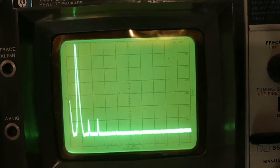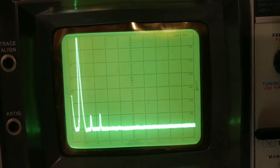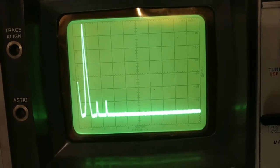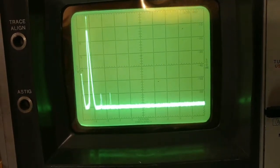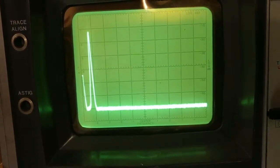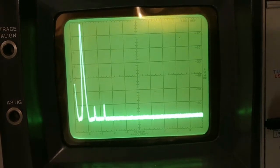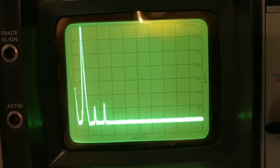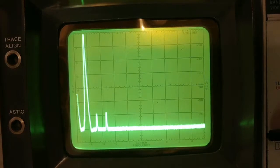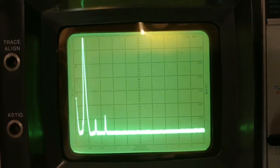And this is a 50-watt signal with, that's Class AB. And you see the second harmonic and some other mixed product that may be internal to the scope is visible just on the right, those 2 little pips on the right. And if I go into the Class A mode, they're gone. The output drops about 12 dB. Even accounting for that 12 dB, if I turn up the RF gain, bring it back 12 dB, should be cleaner than that.